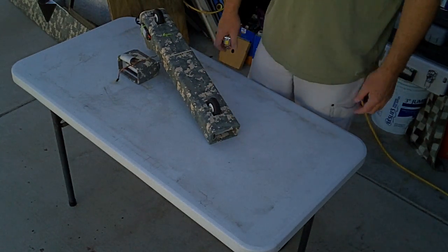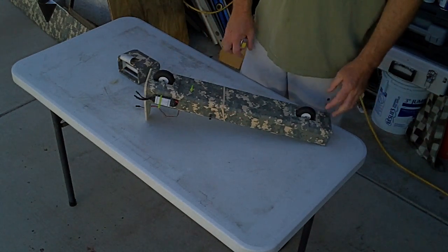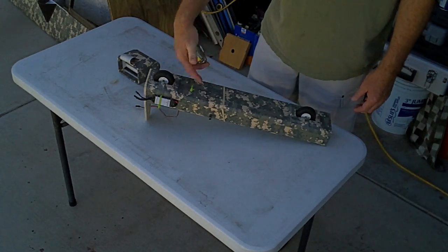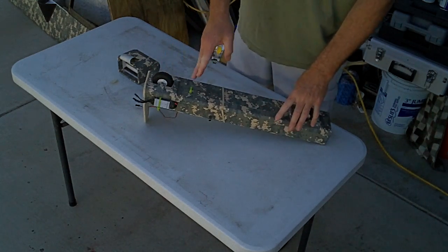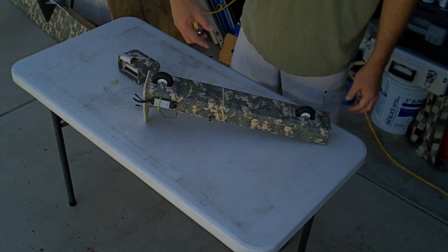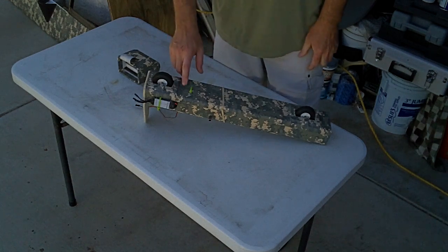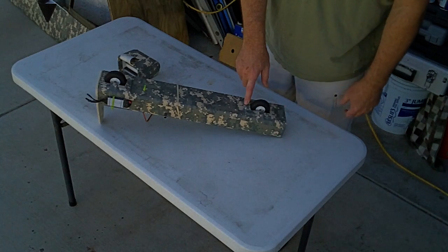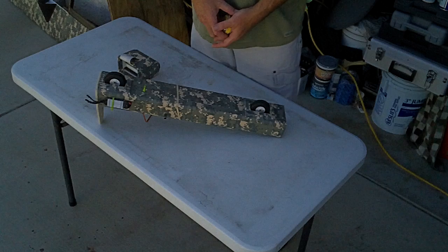Alright, so on the bottom, I have these inline wheels, which to me is perfect. It's really low profile. I don't have any metal gear hanging off of here. That's also additional drag and additional weight. And with aluminum gear hanging off here, this would have to be reinforced, which adds additional weight, because that landing gear would easily rip out of this foam board fuse. Then you'd have to have a steering nose wheel, and that takes reinforcement and another servo. It all added up to additional weight.